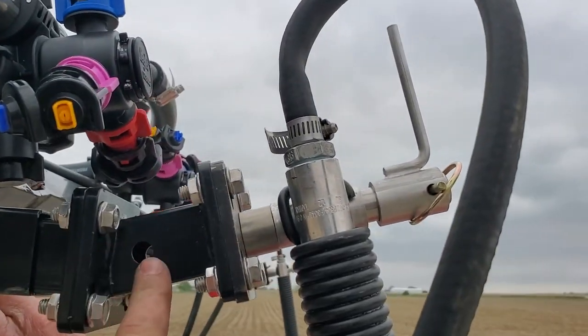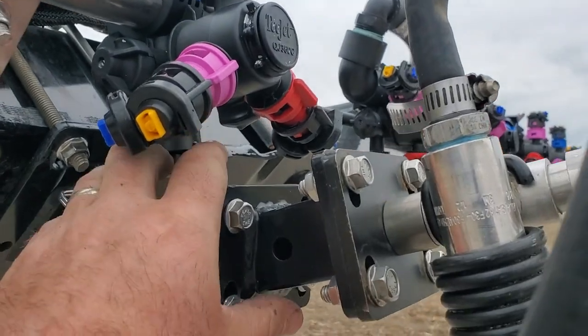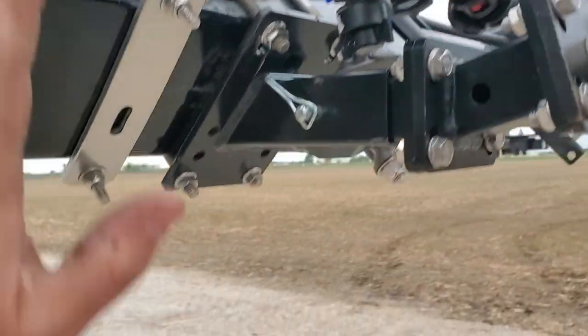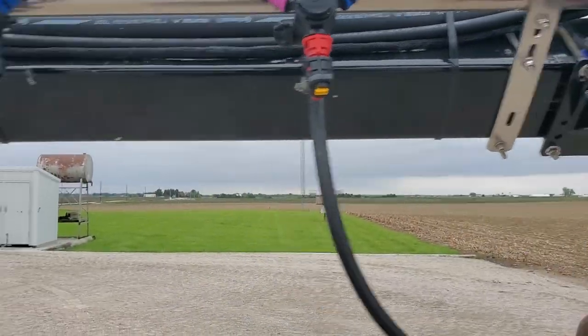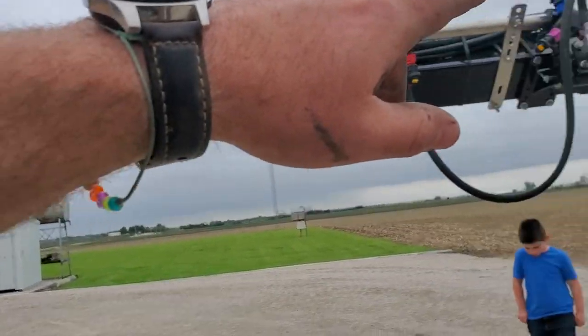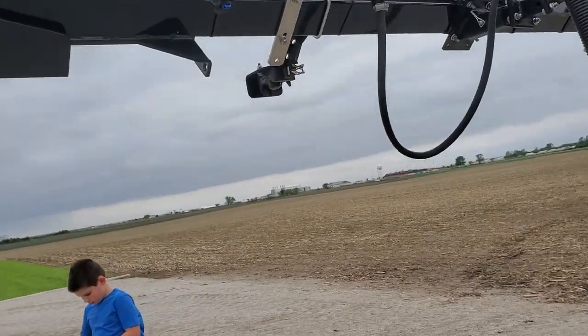That's a 5-inch plate with 5-inch u-bolts and a 6-inch extension. The shim is just to balance out the fish plate. This customer has chosen to just do extensions and keep it nice and tight, which I like. But if you need that fertilizer port for something else, you'd be mounting over here with an offset — and we'd basically be able to get away with 5-inch plates on all of the secondary, or at least positions one, two, and three, if we did offsets.